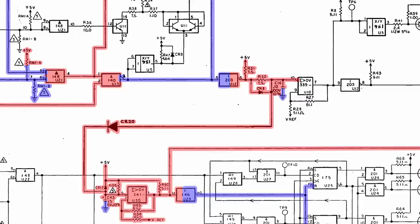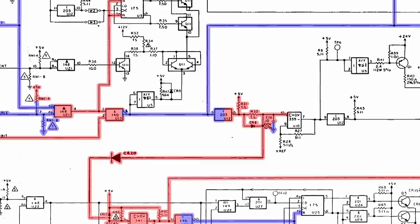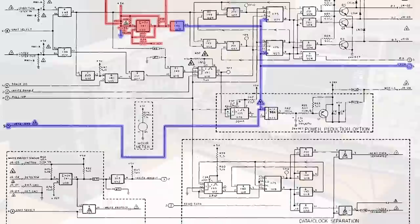The erase inhibit line is just coming from a 7405 inverter, and we can't figure out why that's important. The best we can come up with is that when the erase inhibit is pulled low, the amount of time to charge C43 is different, thereby changing the amount of time that the circuit sits in power on reset. But either way, it doesn't matter because this 339 is totally dead and we replaced it.